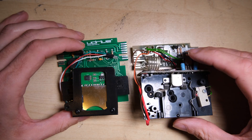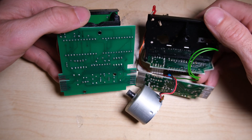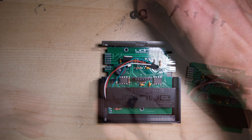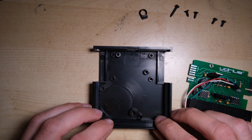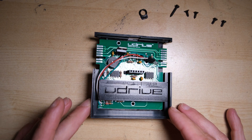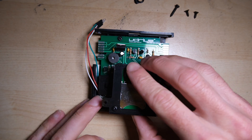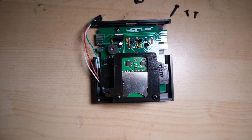The V-Drive is a lot lighter because it doesn't have a motor. The V-Drive comes with all of the fixings that you'll need, although if you are replacing the unit of an old microdrive, you can reuse the screws from that. You will need this spacer to make sure the board sits flush on the case. With two screws holding the board in place, we can pop on the SD card reader. This is designed to sit centrally in the opening in the case where you would normally put the microdrive in.